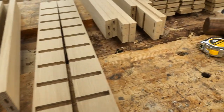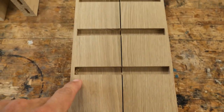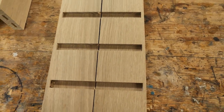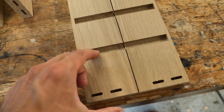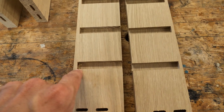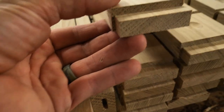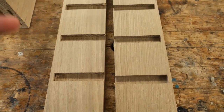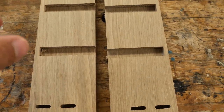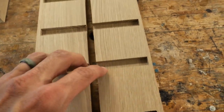Okay, so all the parts have come off the CNC. I've come over here with these sides and squared up all these corners. I don't typically do this. I could run a 1/8 inch bit to cut these and have just a slight radius and make it work. With a 1/4 inch, it's too big of a radius. Obviously our shelves have squared edges, so it's not going to be a good fit. The trade-off is it's a lot more time on the CNC when you run a smaller 1/8 inch bit to cut these pockets. And I can square these off with a chisel pretty quick.